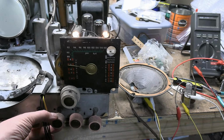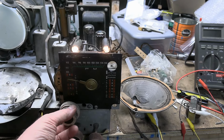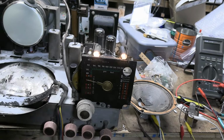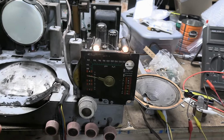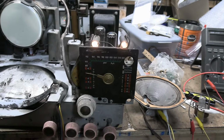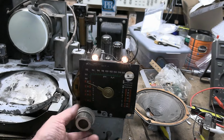Alright, so we should get something around channel 6. So this dial's off, so I'm not quite sure where it's going to kick in. So the lowest around here is, so 87.7 MeTV FM. It's basically where channel 6 is on the dial. So I think that's probably what I just heard. So yeah, this needle, I already noticed that earlier, needs to be moved. I'm not quite sure how you do that. You can't force it, really. All these gears are rather tightly meshed. Maybe there's a trimmer cap we can adjust or something.